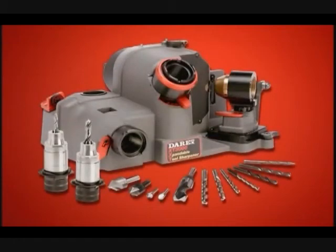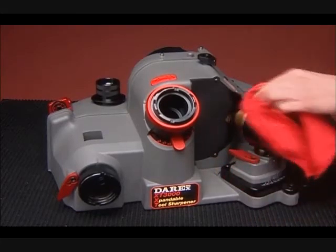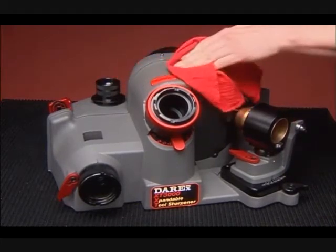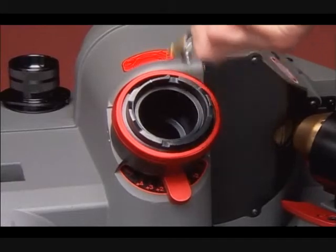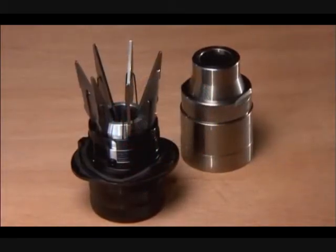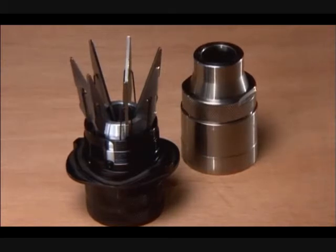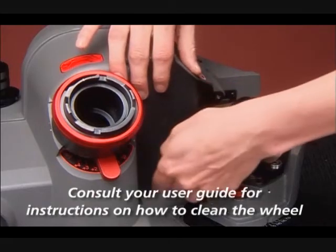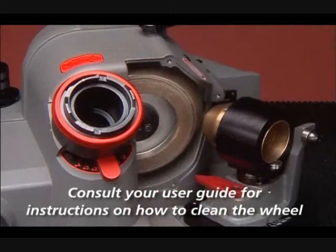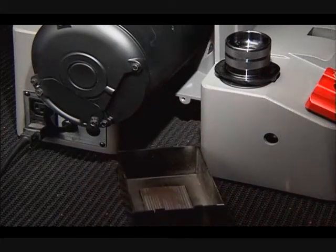Maintenance and Cleaning. Your Derex is a precision tool and should be cleaned regularly to remove dust and grit that can wear down the ports and chucks. The process takes about five minutes and covers cleaning the chuck, the alignment port, the sharpening wheel area, the sharpening port, and the splitting port. Unplug your Derex before beginning. Use a dry cloth, a one-inch vacuum hose, or compressed air to remove dust particles from all ports. To clean the chuck, blow compressed air through from the knob end; consult the user's guide for thorough disassembly if needed. The sharpening wheel will need to be cleaned and occasionally replaced — remove the cover, unscrew, and replace with a new wheel. Empty the grit tray located in the back of the machine.